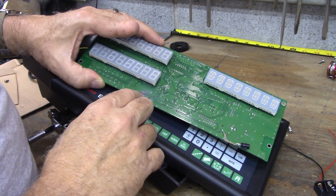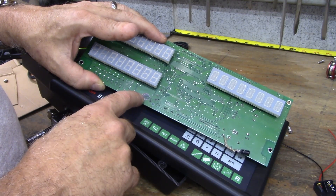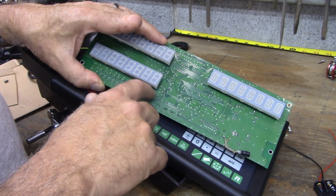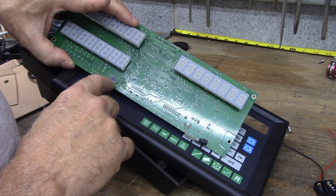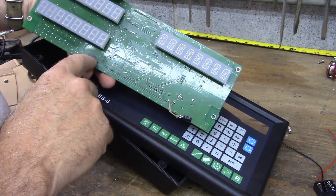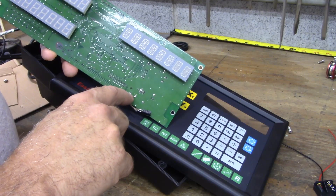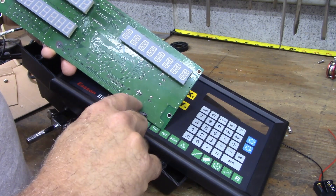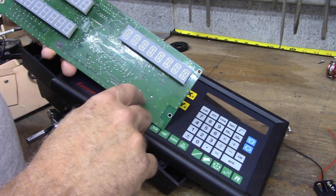What made it quit working was the capacitor was messed up, and it also lost its ground connection over here. When looking at a circuit board, all of the green part is the ground. I lost the ground to the capacitor, so I moved it down here. Following the trace, this was the positive side of the capacitor — that trace runs right down to a little stud where it was soldered. I took a little piece of wire, soldered it on there, scratched a bit of the green off, and soldered the other wire to the ground.